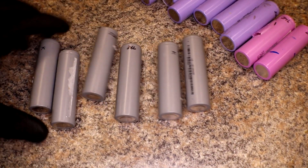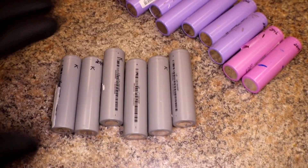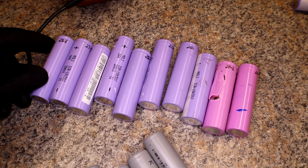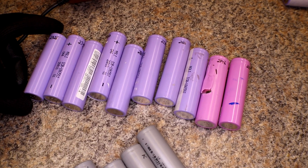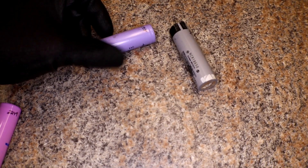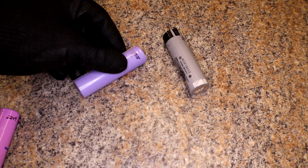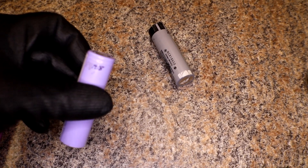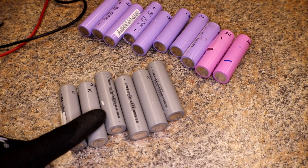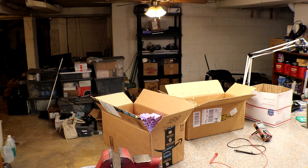Before I do that — I did have a couple of lower cells and I found some Chinese ones in here, the gray ones. I don't know if I'm going to use those yet; maybe put a comment down below if you think I should. There are five or six in there so far and they all have pretty good numbers. These cells are just a little bit under four volts, around 3.95 or 3.96, which I don't think is too bad since they've been sitting in there for damn near a year and a half. I did have one with corrosion on the bottom — this one is a 1,918 milliamp hour. I don't know how that got in there. Maybe I'll recheck it. I'm just going to retest those, let them sit, and put a comment down below if you think I should use them.